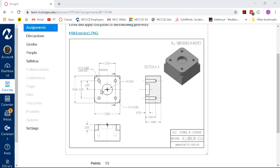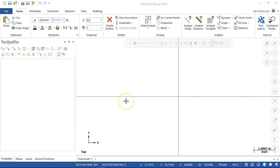And so one of the things I say in SolidWorks all the time is draw for convenience, design for convenience, detail for manufacture. We're going to draw this as conveniently as possible, as quick as possible, making sure that we have the geometry pretty much like what's shown on the screen. When we come down to the programming, we're thinking about where our work offsets, where our best coordinates are going to be, and work from there.